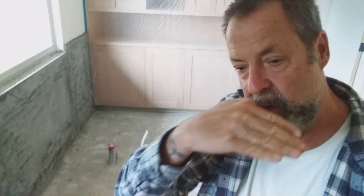Another way you can do it: you can get a dry blade and cut. What I've done is cut a bunch of lines in the concrete, then take a hammer and chisel and actually chisel out the concrete. That's a pain, but if you do it enough you can get it done — you've got to cut a lot of lines in there and get a good chisel.